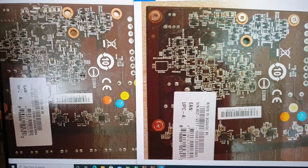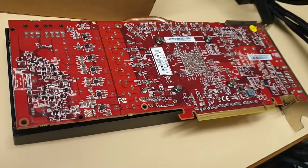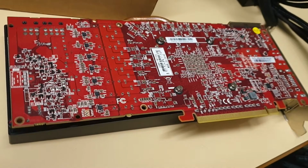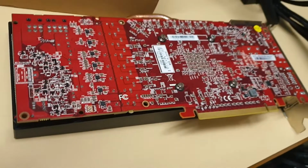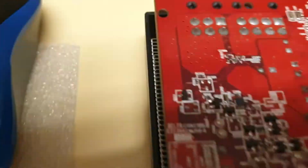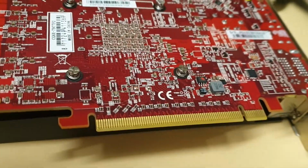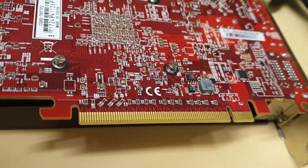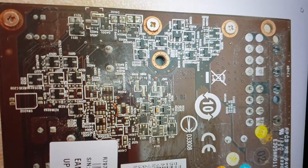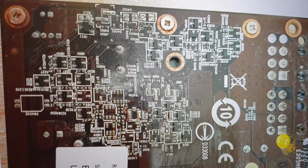Many of these cards, because they don't have that backplate shield, have a million components there which can be knocked off or they can be burned, so you should see it. But anyway, if you're tracing the fault like this, you don't have 1.8 volt, you got all the voltages like 12 volts, 3.3 volts from PCI Express here, and you got 12 volts here, and you don't have 1.8 volt, which basically ensures communication with the BIOS and the computer. As you should see, the fault wasn't around the drop down regulator, it wasn't around the logic end.